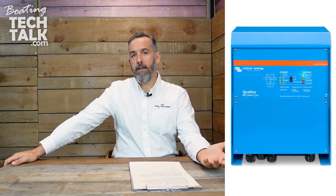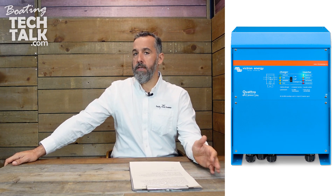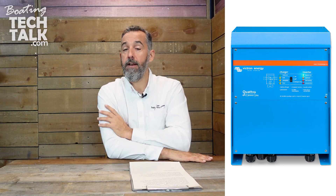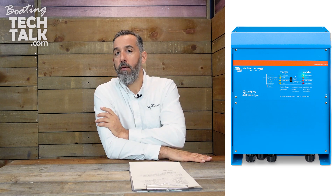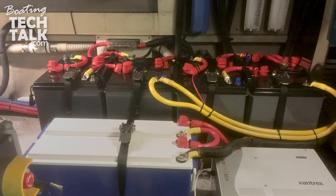Now, the challenge with testing your inverter charger is that device is really two things — one name, but two things. Your friend is right: your inverter is most likely not operating when you're connected to shore power. It's good to check if your inverter works by pretending to be away from the dock — connected to dock without power for a day — so your inverter is powered from your batteries and you can confirm everything works as expected.